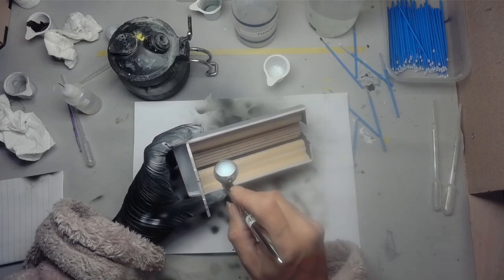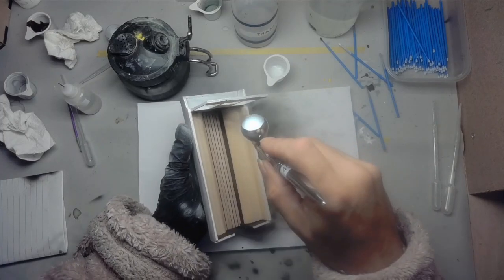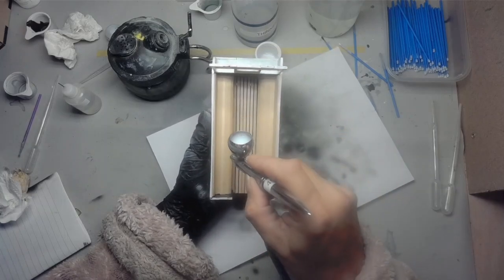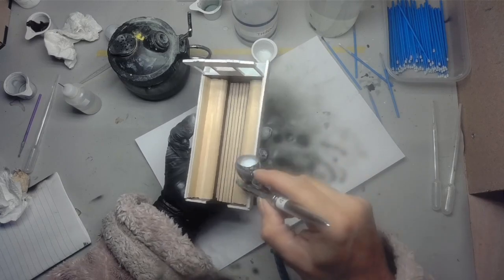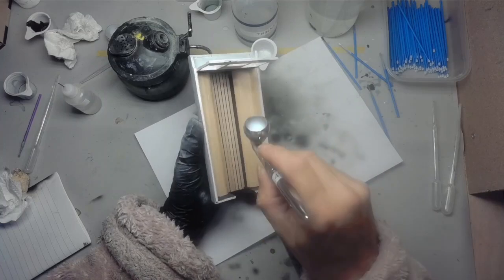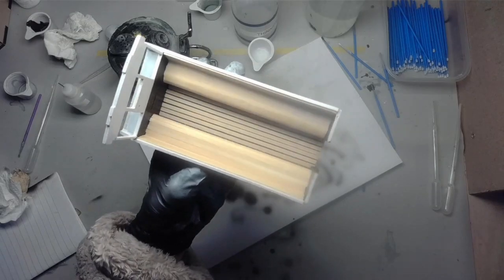So the way that I'm varnishing this is I've got it nice and thin, much thinner than usual, somewhere between half and a third varnish, and the rest is thinner. And I've used a slower drying thinners. I've put a little tiny bit of retarder medium in, and I want it to give it more time to settle, and I've just done some nice coats backwards and forwards until I'm happy that everything is done.